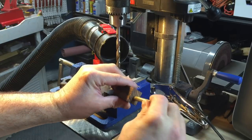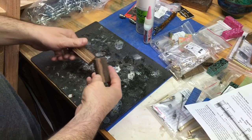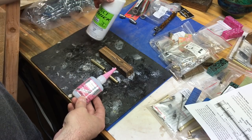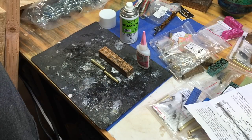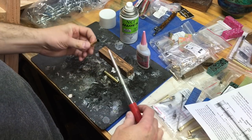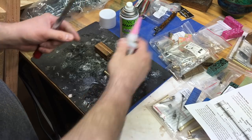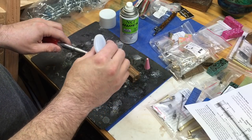I'll do a quick check to make sure the hole is alright. Now on to gluing the brass barrels into the wood blanks. I use CA glue — short for cyanoacrylate, a super glue — and I'm going to use a CA accelerator to speed it up, or else this flex CA glue will take four hours to dry. It's a type of CA glue with superior shock resistance for expanding and contracting, which is good if somebody drops a pen. I'm using an insertion tool to help keep my skin from sticking, which CA is very good at doing.